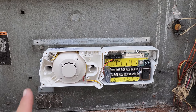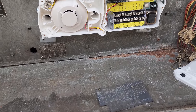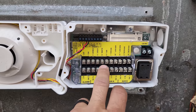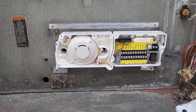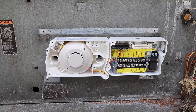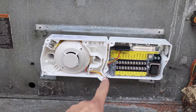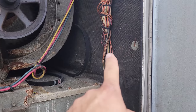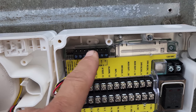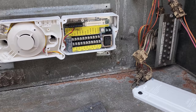This replacement is an outdoor one — it's supposed to be waterproof, so it has a solid cover and you can't see the indication LEDs. This one also has the ability of having a second detector with one control assembly. You can mount a head in the supply and a head in the return and just have one control assembly. It also has tamper sensors. I really dig this detector — it's super nice.